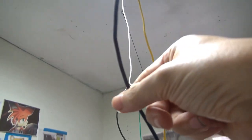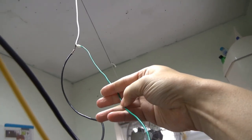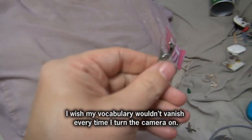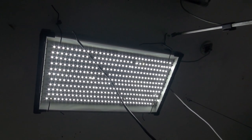So I've taken the clip ends off these clip leads and I'm just giving this a test run. The negative is this big thick black wire and the positive is the clip leads. They're getting pretty warm, but nothing that I would call dangerously hot. I think the main problem was basically just contact resistance — where the wire connects to the metal. I've had this running for about 5 minutes now and I've seen no sign of any flicker.